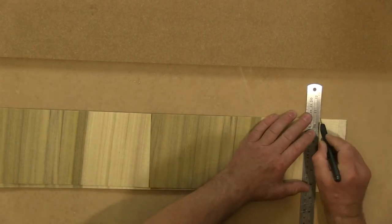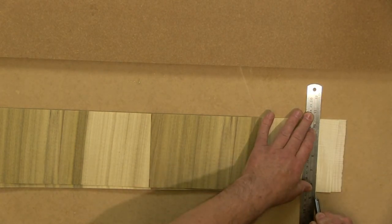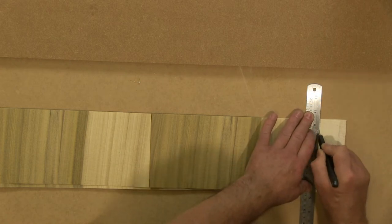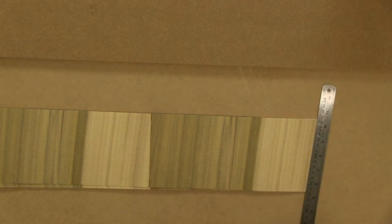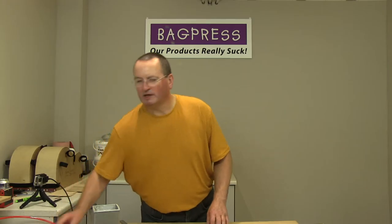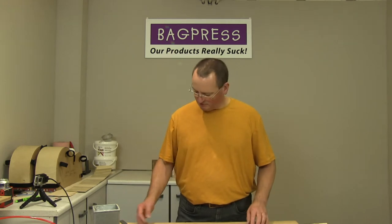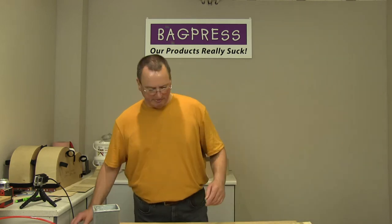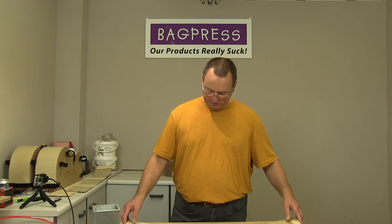Yeah, just trim that down there. Now, the sides I'm pressing at 135mm wide, which is quite a lot over where they'll end up being finished. I think they end up getting trimmed back probably 10 or 15mm from there, maybe slightly more. But there's no harm in pressing them wider, and then it just gives you a bit more leeway when it comes to positioning on the mould.